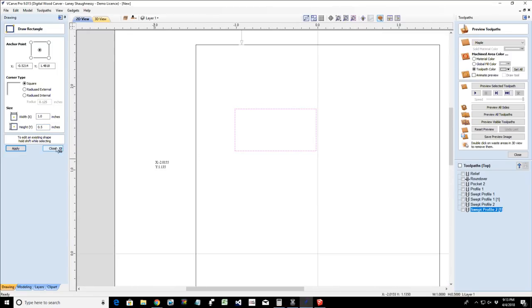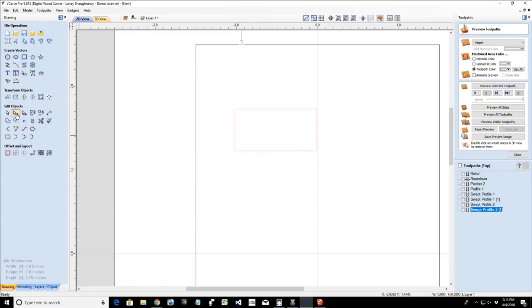And on this, I'm going to go into node editing, and I'm going to create and delete that span. And I'm going to take this right side and snap it down halfway, and I'm going to take this straight line, right click on it, and turn it into a Bezier curve. That way I can curve this up a little bit, curve this down a little bit here.